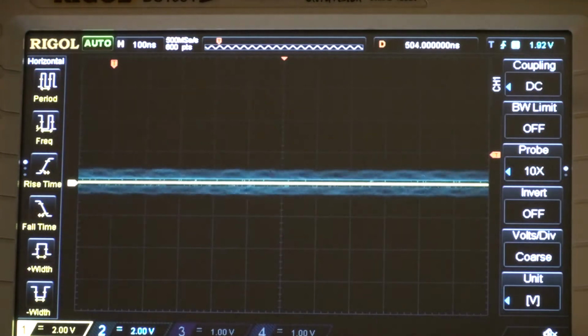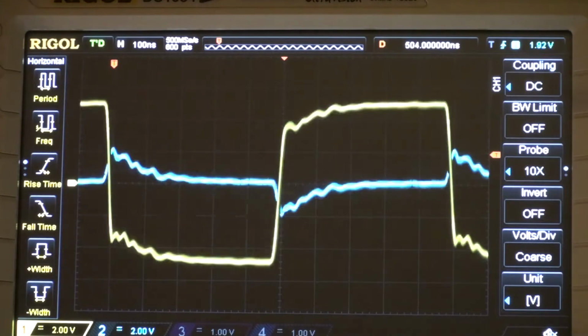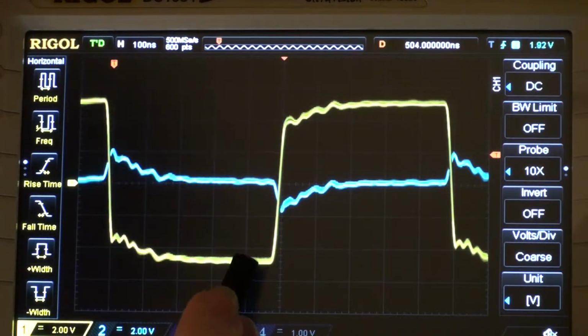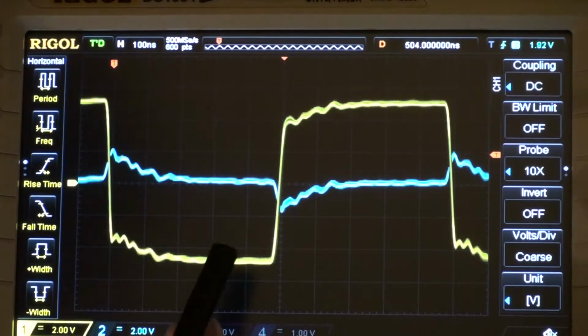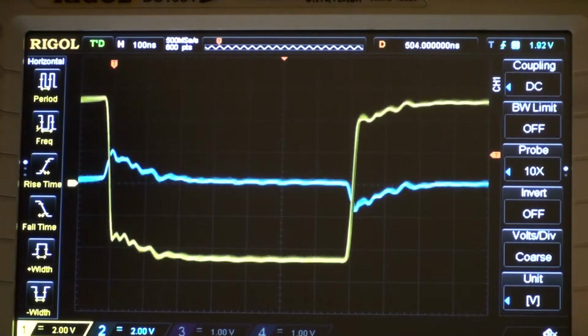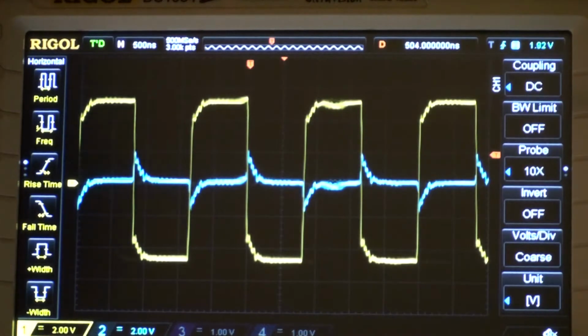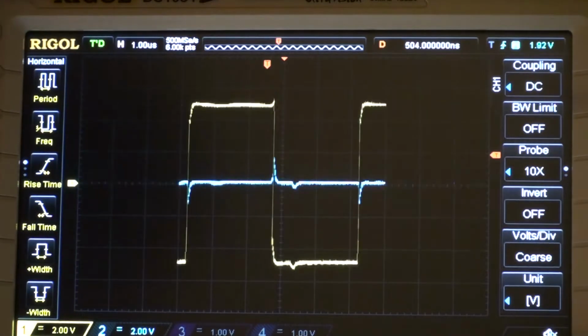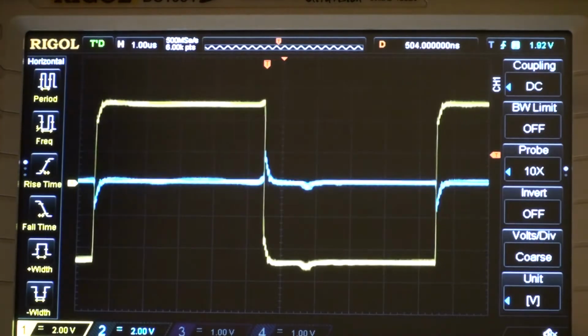All I need to do is just short the... So let's short the yellow trace to the probe, and then we can see how many volts we're feeding out. So now the yellow trace should be what our signal generator is generating. And we can see at 1 megahertz it's not generating the nicest square wave to begin with, so maybe 1 meg is pushing it. We can go down a little. So let's go down to 100 kilohertz again, which obviously generates a far nicer square wave, but